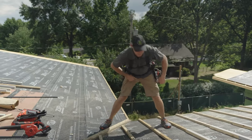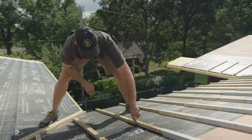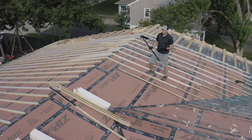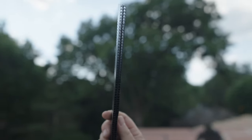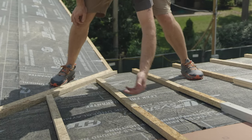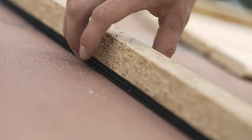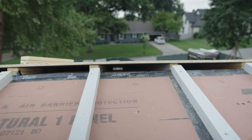It basically planes out, but then you can see where it gets complicated. I need venting to get to this valley. So underneath my inch-and-an-eighth plywood, I've used Benjamin Obdike's old-style UV batten material — this is an off-label use. This is me deciding a good way to get airflow across here. We're fans of Obdike, and we had this UV batten material left on another project, so we can apply it here and allow lateral venting. Air can come up through the vent space back at the fascia, move into this cavity, and cross-ventilate all the way up into the valley. That's why all these on the inside edge of the valley have that little black strip underneath — we're moving air up to the ridge across each of these bays utilizing the intake from here.